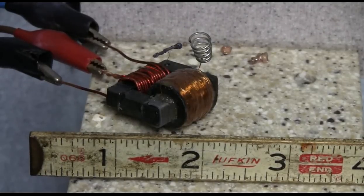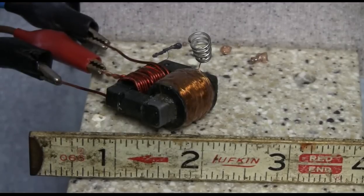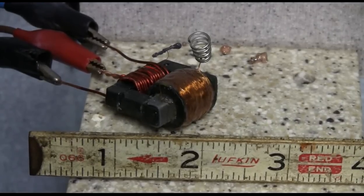Here's a really small flyback that I made. The ferrite core is actually four separate little bits of ferrite glued together with cyanoacrylate. The primary is six plus six turns of solid wire. The secondary, on a little insulating bobbin, is number 34 wire just scramble wound to about three-sixteenths of thickness, and insulated with epoxy.